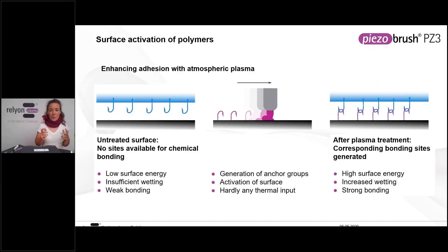We'll move on to how wettability relates to bondability. At the molecular level, the uppermost atomic layers are really significant for bonding — about five monolayers of the surface. If you have PTFE, these layers are more or less inert: there are no bonding sites to engage with the liquid, say the ink. What the plasma treatment does is generate end groups — anchor groups. These anchor groups are typically polar because we work at atmospheric conditions with a lot of oxygen species. These groups can correspond to polar groups in the liquid and therefore form a chemical bond.